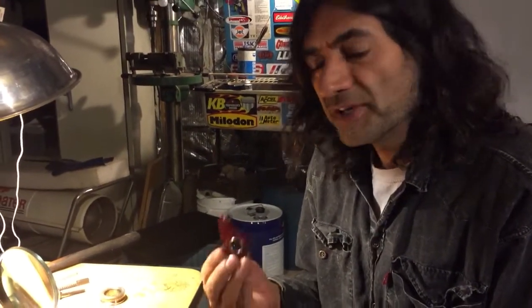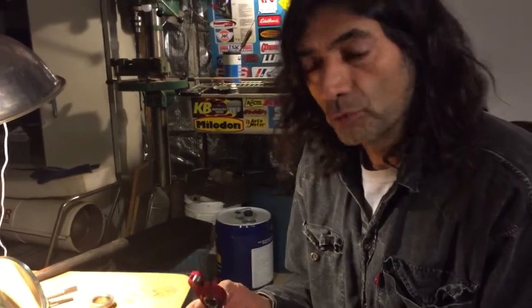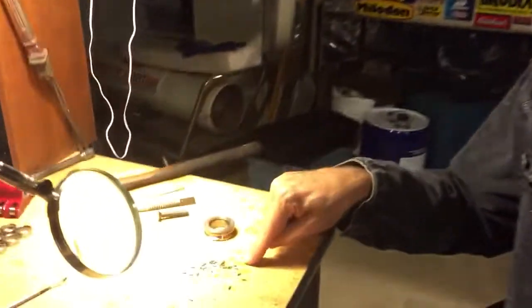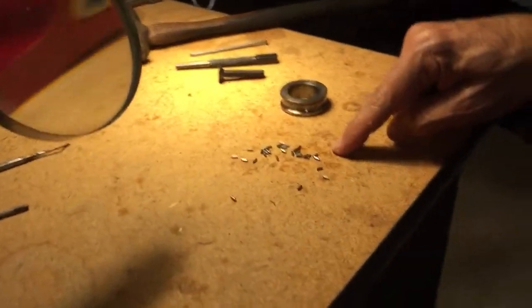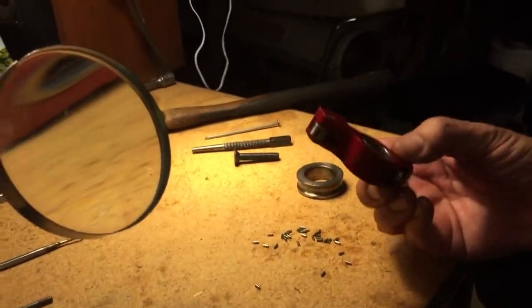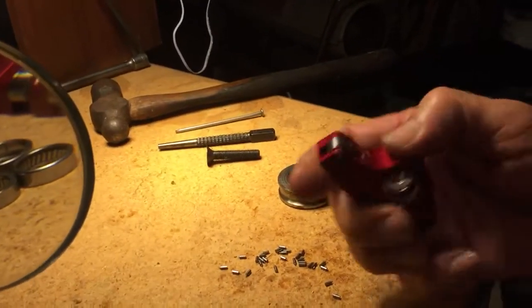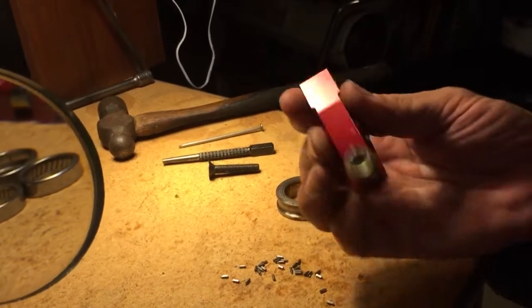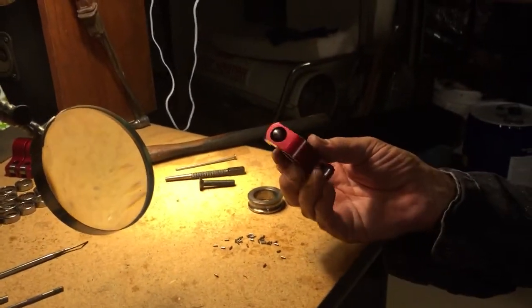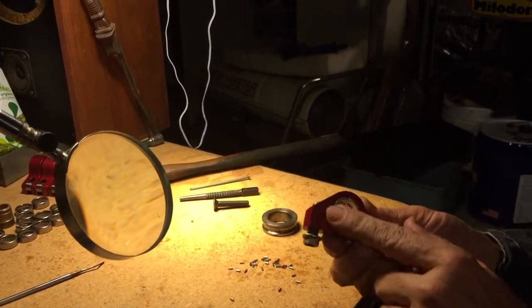For our Sprite race engine we've been dealing with an issue with our roller rocker set. The problem is our roller bearings came apart after barely more than a couple of dyno runs since we installed this new shaft. We tried to get another one but it had an issue with one of the rollers, and it was an older style we couldn't make fit our valve cover, so I decided to source good quality bearings.